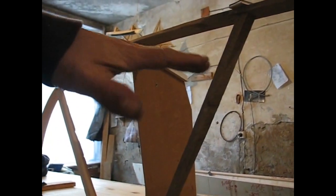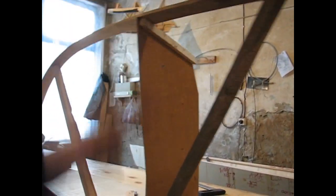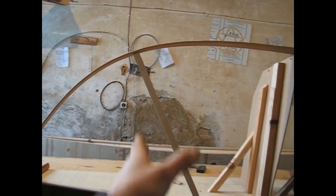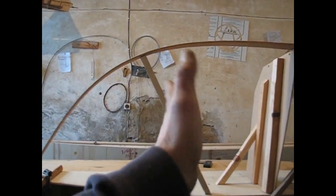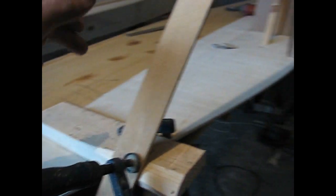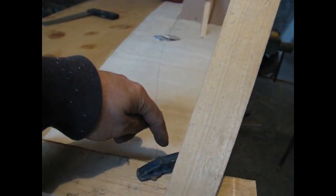This batten's just holding it to prevent too much flex. That's our centerline. Now we're going to start working on the two bulkheads that come on the sides. They'll have some sort of shape and probably a little bit of an angle. And when you imagine the line of the bottom of the lee pod — that really comes up to a sharp point. The fact that it's kind of squarish on the front doesn't matter, because the touchdown is over there and you've got a nice, wide, long, straight base that lies on the sea.